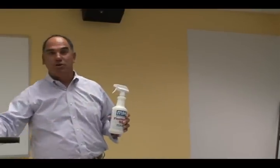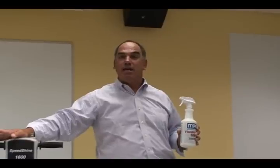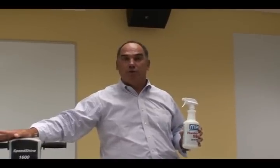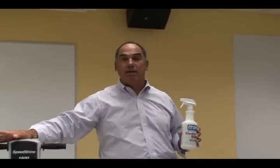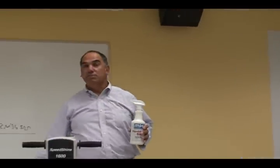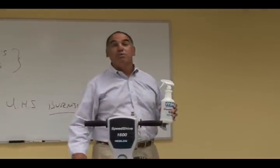With a burnisher, you must remove the soil some other way. So you can't use the burnisher to get dirt off the floor. It will ruin the machine, it will ruin the floor, it will lead to yellowing. We never use a burnisher. That's a machine that's turning 1,000 or more RPMs. We never use that machine to remove dirt from the floor.